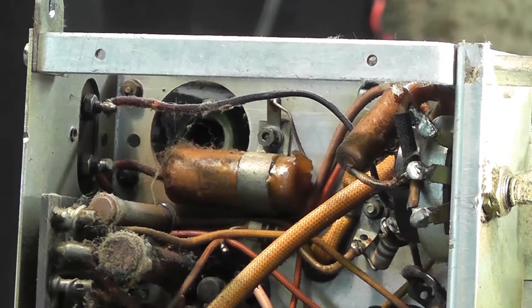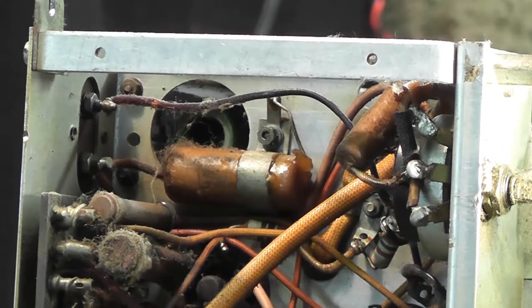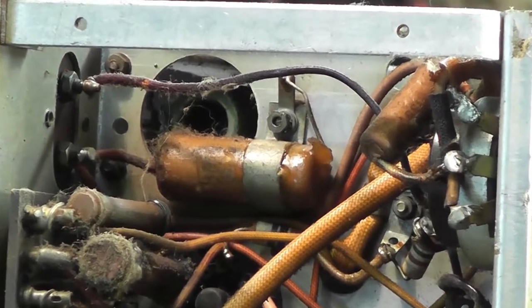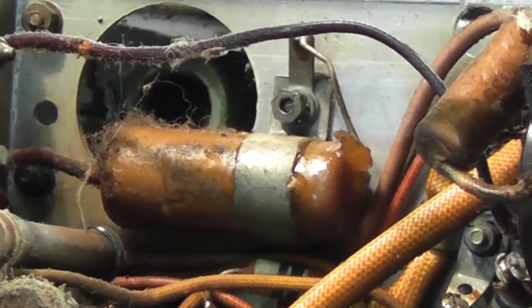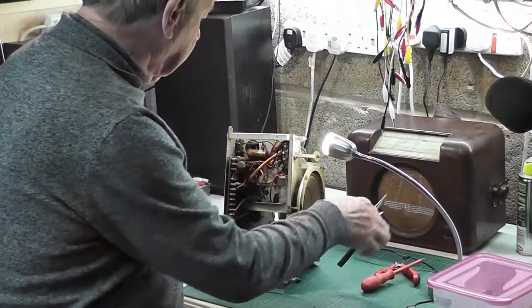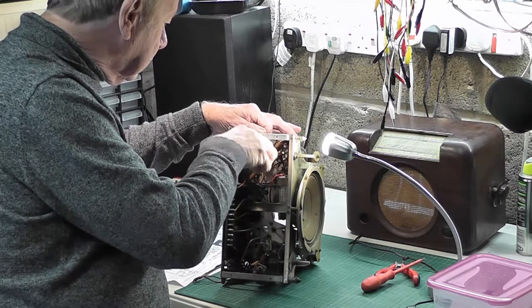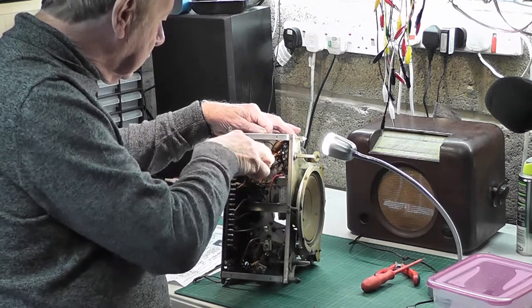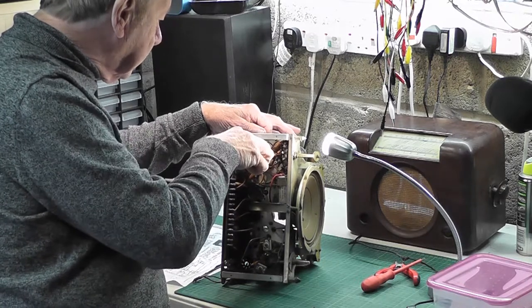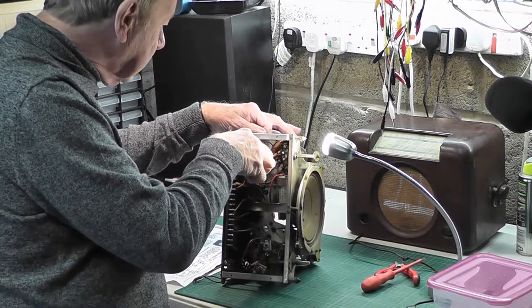This is the underside view of the main dropper resistor, and you can see the rather leaky 0.01 mains bypass capacitor there, which is going to be removed. The screw which we can see here is the one that's holding the main dropper case in place, so that's going to be removed. I'll be glad to get rid of this asbestos casing. What I like about these radios — everything is nuts and bolts, it's all done really rather nicely.